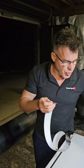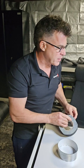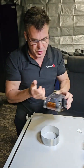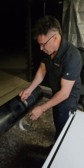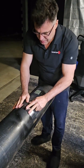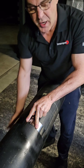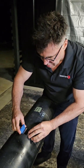Now to put this on, the easiest way is to use the magnet of our M-RUT-C medium-range shear sensor — it's probably the easiest way. But we leave the backing tape on. We wrap this around and line it up. If you end up being a little bit off, it doesn't really matter, but if it's too far off we'll get an air bubble underneath and that won't give us a good scan. So we stick that magnet on there.